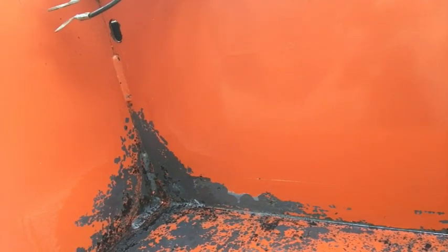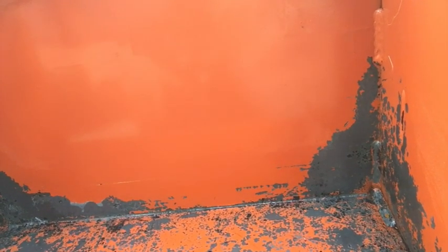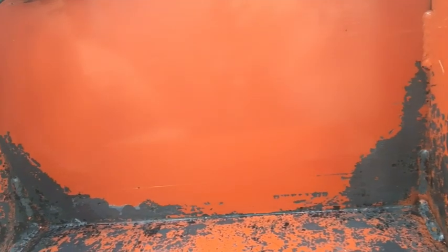This box is on a 2012 Wood-Mizer sawmill. The box isn't that bad. There's just a couple of places where you have the black pitted areas where the rust is really getting into the metal. All the rest that you see here, where it's a light color, is where the paint is starting to bubble. Whenever you have paint that's starting to bubble, then you're going to have places for moisture intrusion, and then you start getting the pitting. Some of these bubbles in here were caused from me.